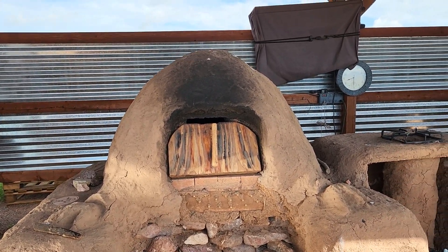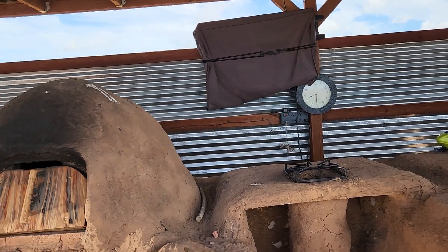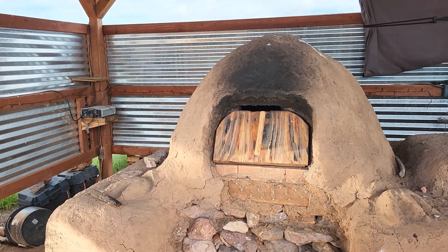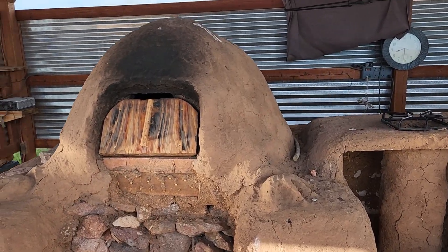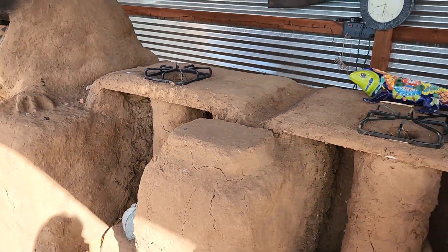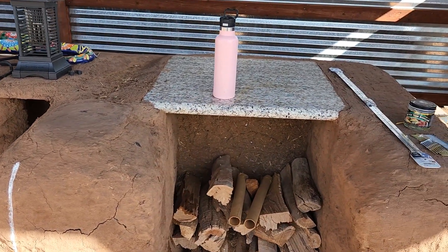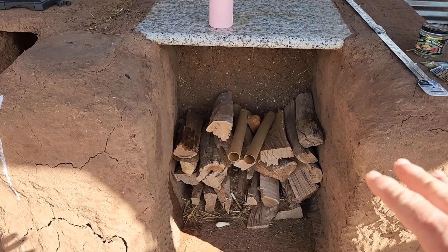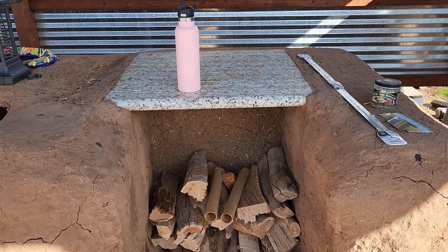The whole design is like several U-shaped areas all made with earthbags. It took 150 of the 18x30 sandbags filled with damp soil, tamped with barbed wire in between. We just kept making U-shapes and made our sections. This section was always going to be a countertop — a prep or serve area — with the area down below for wood that we need for the wood stove.